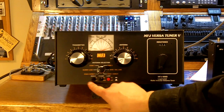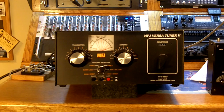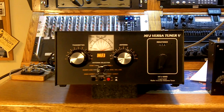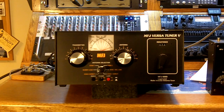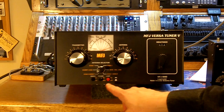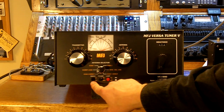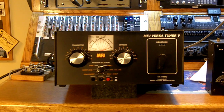The range switch is high and low for your meter reading — either the 3,000-watt indication on the meter or the 300-watt power level. This is a full legal limit antenna tuner. Not all antenna tuners are, so you want to be sure of what you're using and what kind of transmitter power you are running. Set this to the low range if your transmitter is less than 300 watts, and if it's more than that, use the high range.